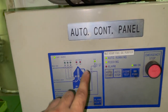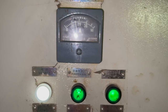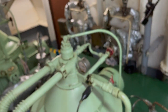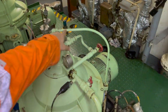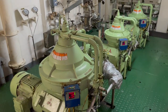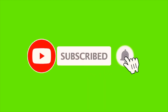Once the desludge has happened, the bowl closing water comes again, then the displacement water, then the feed oil returns and the RPM starts to come back up. The amps return to normal — 14 amps for this specific purifier — and the feeding LED comes back on. There is also a gauge regulating the recirculation pressure. The displacement water line comes from the top of the purifier between the dirty oil inlet and clean oil outlet valves. Always remember to adjust the back pressure when starting the purifier for the first time. Thank you, and be safe.